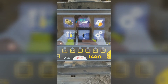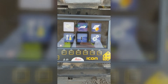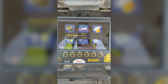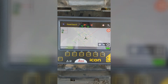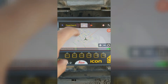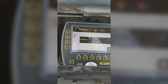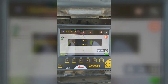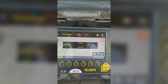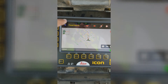After your total station is set up, hit machine control, hop in your dozer and hit grade. The first thing you want to do is track over to a control point, which is on ground level, not sticking up. Notice we are not locked, so first we need to do a search — we're doing a power search right now. The instrument is turning, scanning the environment, looking for a prism. It's acquired it — it says locked down on the bottom left. Back out.